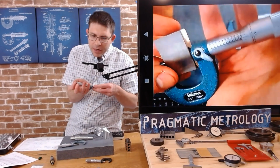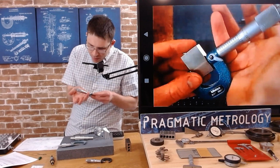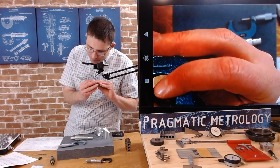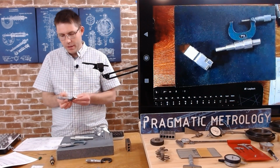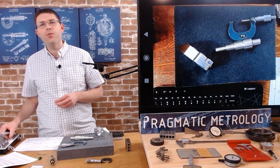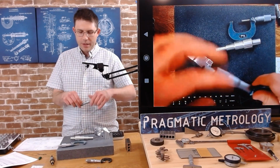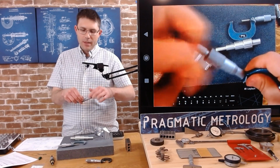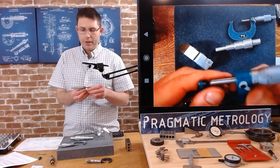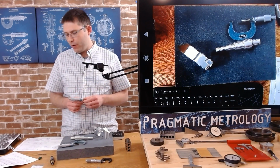So again, just a hair below. Looks like the 0.9 is below again. So it's within my limits. You know, 1/10 can be really hard to take out of a micrometer, as you saw. So we're gonna keep using it. It feels smooth. I'm not seeing any friction that shouldn't be there or any bad conditions all around. So I think we're in good shape.